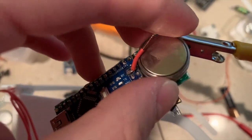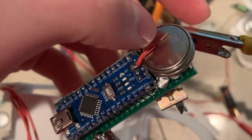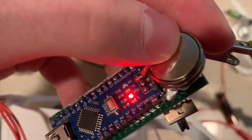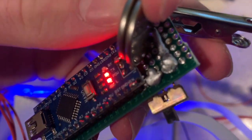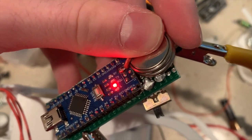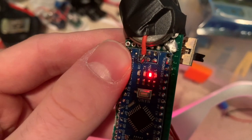So I slide that in like that. I had a very janky way of putting the battery in. The little wire that I'm trying to get to touch the battery actually connects to ground on the Arduino, and the little janky soldering over there connects to VIN. I can just place the battery in, push down, and it turns on. So it doesn't come out, I put a lot of electrical tape around it. Whenever the battery dies, I'll just take the electrical tape off and replace it. I also put a little 3D printed piece on top of the wire to keep it pressed down all the time.